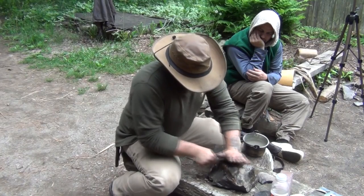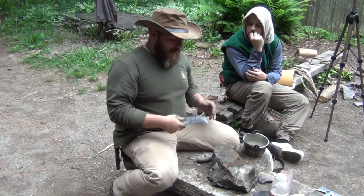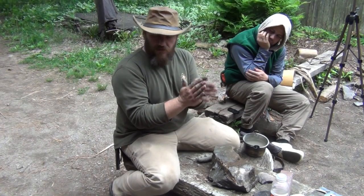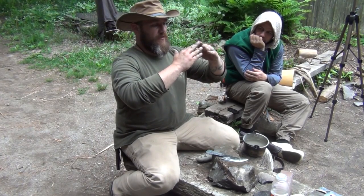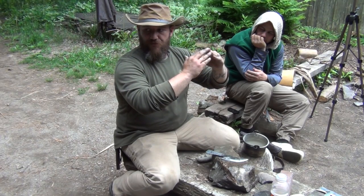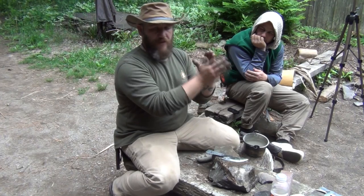So using your hand to grind it from that far back forward with that thickness is going to give a massive curve to the grind. Most blades when they're thin, you don't have to work from way back — you're up close, so the bow isn't as extreme. Because if you have too much material on each side, this leading edge here won't get sharp — it's too fat. My whole reasoning is I'm bringing the shoulder of that edge in so the edge up here is thin.